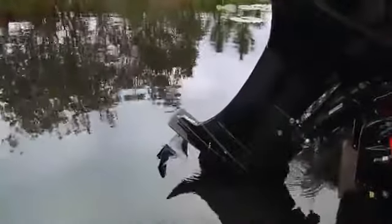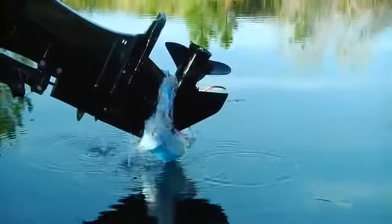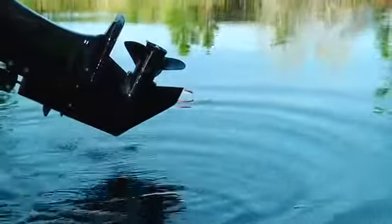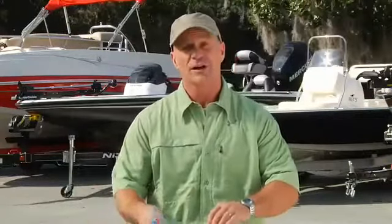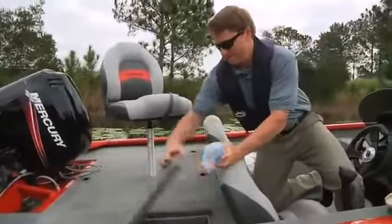Shut off the engine, trim up the engine, and check the water intakes. Make sure the intakes are free of weeds, mud, or debris — this is the most common cause of malfunction. This can occur any time you're out on the water. If you get a warning buzzer, high heat indication, or low water pressure at any time, stop the motor, trim up, and check the intakes. Carelessly discarded plastic bags can be a real menace; besides being an environmental hazard, they can wrap around a lower unit and cut off water flow instantly. Stow all plastic items where they cannot blow out.